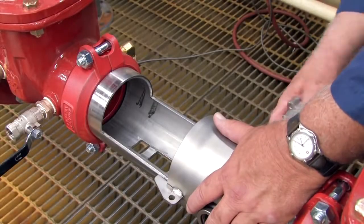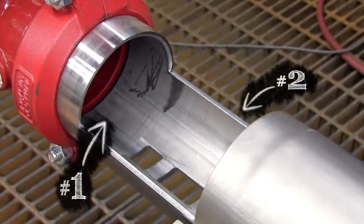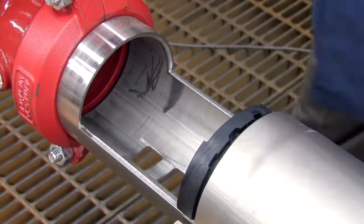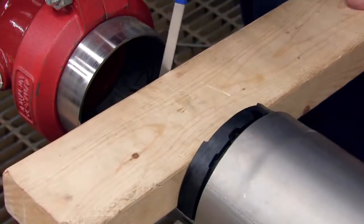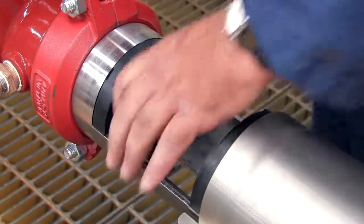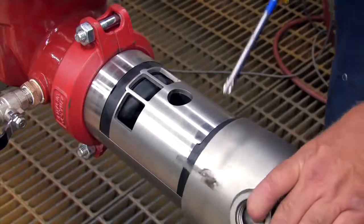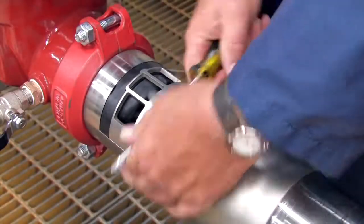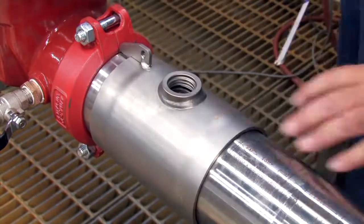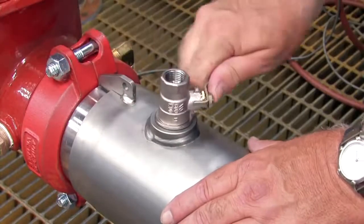Re-attach the relief valve to the bottom of the cover sleeve by hand, being careful not to over-tighten. When rebuilding the assembly, the number 2 check should be replaced first, followed by the number 1. If either check cannot be reinstalled by hand, place a small piece of 2x4 against the check body and gently apply pressure to slide it into place. Thorough lubrication of the O-rings with an FDA approved lubricant will help during reinstallation. With the checks replaced, reinstall the stainless steel retainer plate and slowly close the cover sleeve using a number 3 Phillips head screwdriver as a handle. Re-install the number 3 test cock hand tight, and finish rebuilding the unit by re-attaching the relief valve sensing line with a wrench.